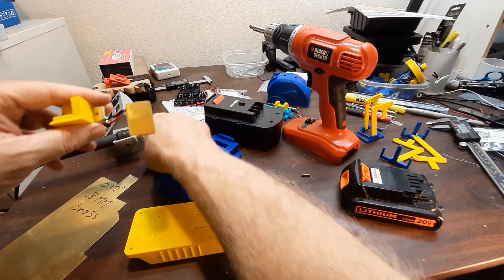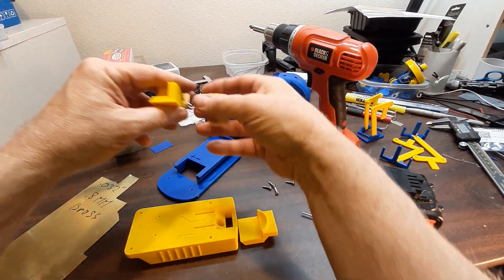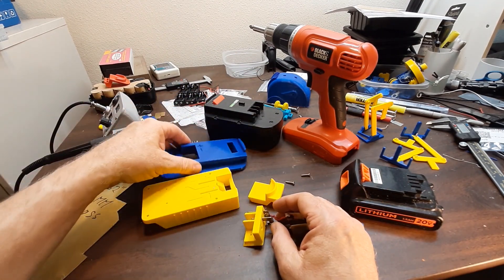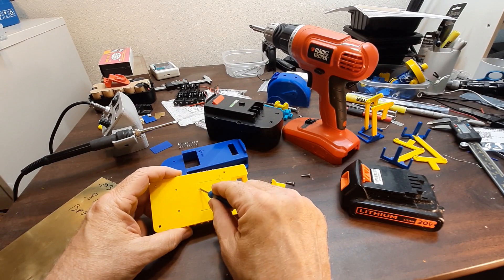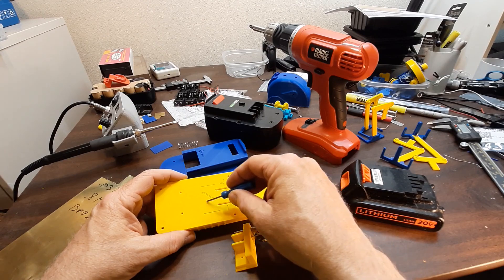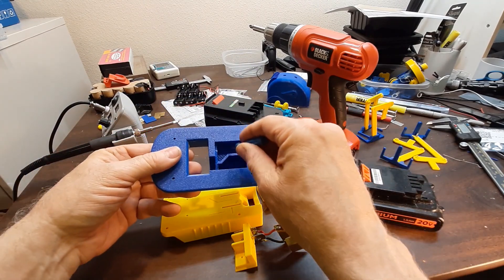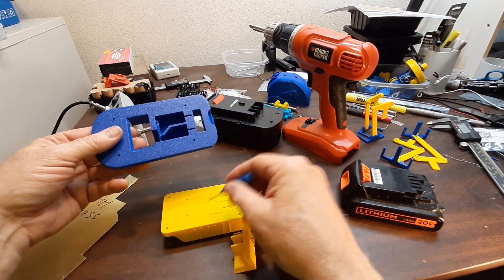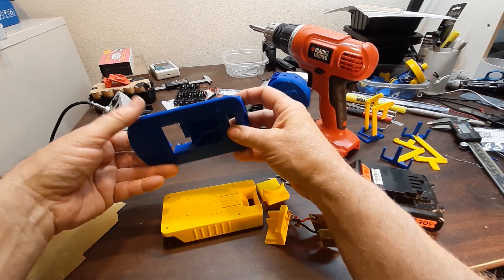I provide a template for cutting out these brass pieces — they don't have to be too accurate; mine is not very accurate at all. I have the polarities marked on the parts. When you assemble it, I put a line in here — you need to keep your wires separated by that line. I decided to put this little barrier to keep, in case one of these wires comes unsoldered, it won't short to the other one.